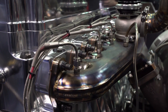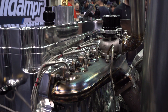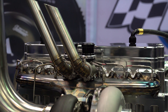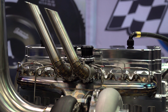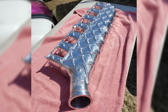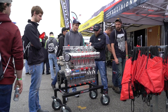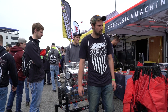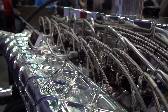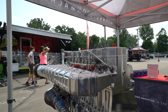That led us into having to make our own exhaust manifold. Steed Speed actually kind of designed that process of the exhaust manifold, but he was so busy that he didn't have time to do it, so he let us use the patent. We redesigned the whole exhaust manifold and machined it in-house, basically using his patent for machining two halves of an exhaust manifold together and welding it together. This whole intake manifold weighs 10 pounds and will take 200 pounds of boost pressure. It took us a week in SolidWorks — stress testing, changing designs, adjusting — until we came up with this setup for the plenum. All the ribs in the plenum are for function, just to get the thing as lightweight as possible while still holding the pressure.